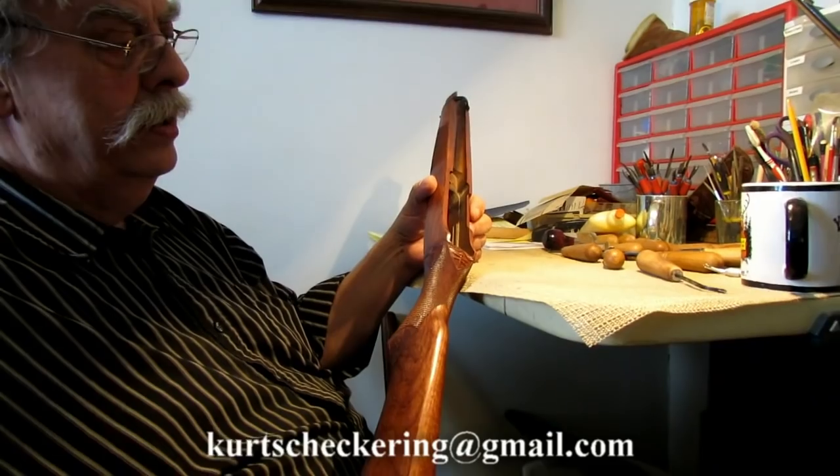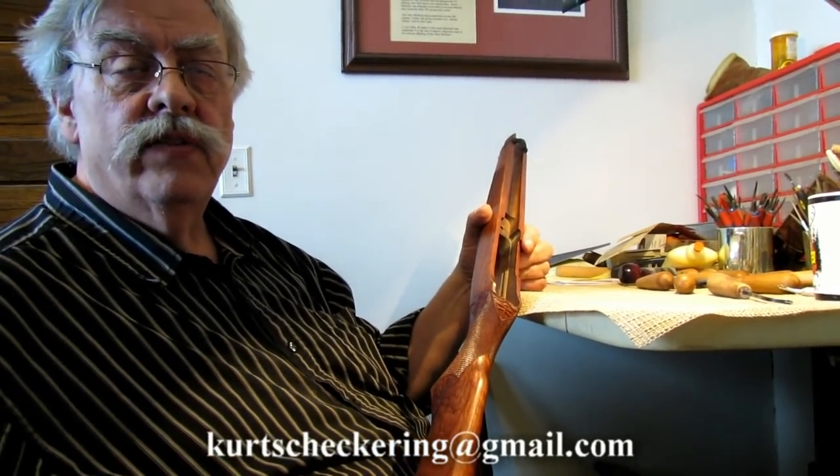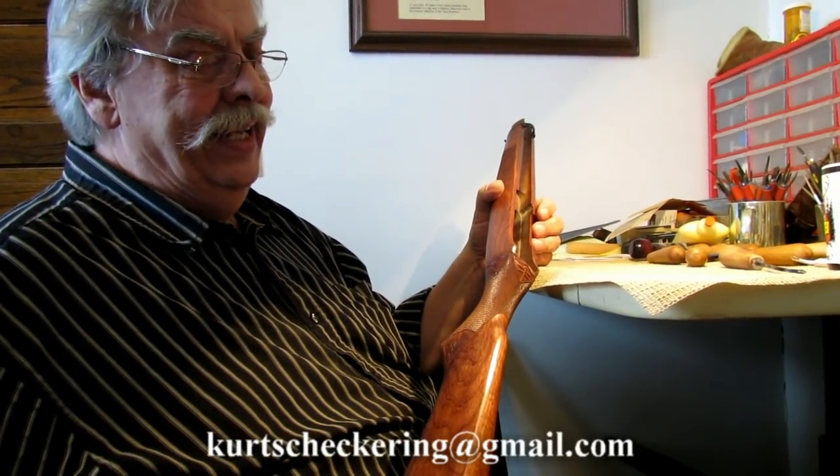You can also stain maple because it is so light. I've seen it stained to a reddish or brown color, and it just brings out the highlights of the wood. However, it is difficult to stain — there are some stains that don't take very well in maple.